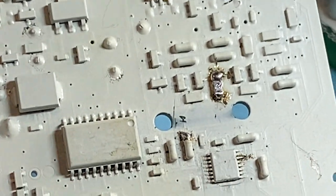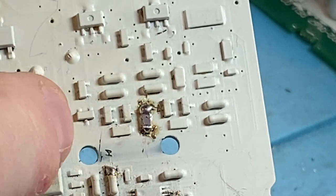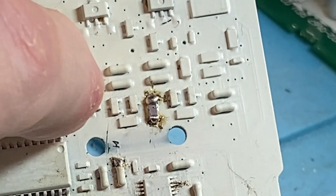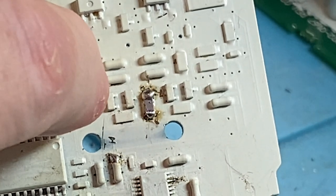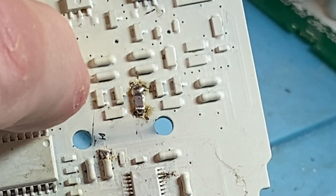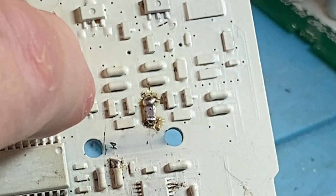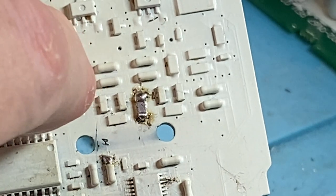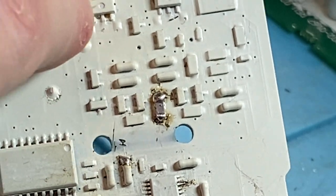That's the transistor I was pointing out, that little driver one. That's a BAV99 there. That's the driver. It's a PNP, a 100 milliamp BC857, I think, from memory. Anyway, don't put a slug in there. Put a good transistor. Those transistors come in different noise grades as well: A, B, C, D, E, F, G. Get a G, they're the best. You don't want noise generated into the gates of the receive FETs.